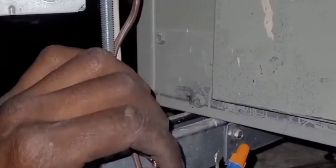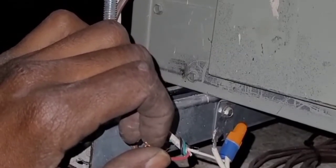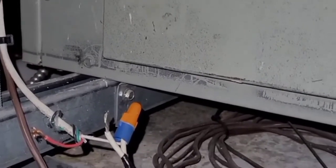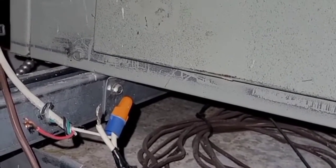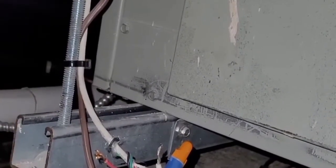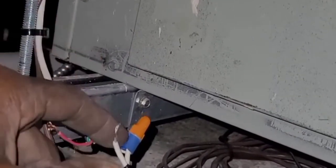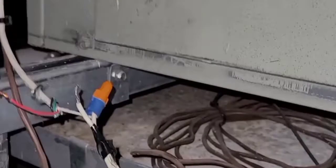That's basically what I found. What led me down here was I was getting 24 volts at my R at my condenser while calling for cooling, but I wasn't getting the 24 volts back up there. I tried to jump it out at the condenser — that would automatically let me know if the thermostat's no good — but when I jumped it out the unit still didn't come on. That told me there's something else going on with the air handler and thermostat, so I made my way downstairs, powered off at the condenser, came downstairs, and took the cover off the thermostat.